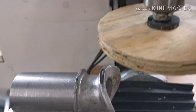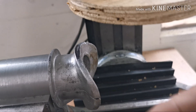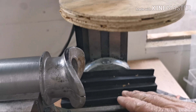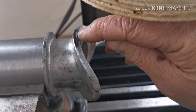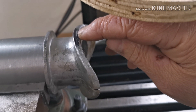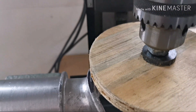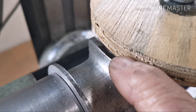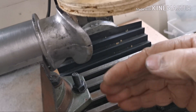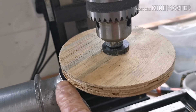With the center of the drill I have centered up this way and locked the cross slide down. I've put a scribe line there — that is where I've got to machine to — with a five-inch diameter curve for the smoke box. I've made a five-inch disc so I can get the mark to where I've got to machine to. Now I'll lock the carriage down and the cross slide down in both ways, put the boring head in, and then we can start machining.